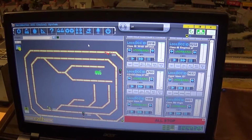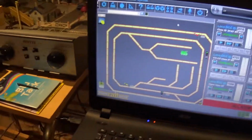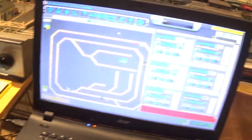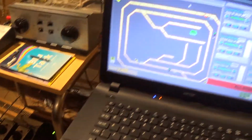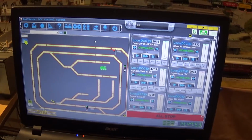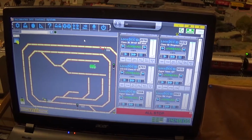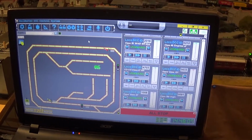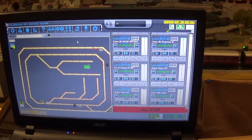Now, remember I said it's not the user-friendly way to say what you've got to do. Mine's the E-Link, there it is. So, you plug that in first, and your PC should recognise something's been plugged in, but doesn't know what it is. So it's going to say USB serial port. You need to find out what COM it's using. Now, COM is communication. That's how it talks to your PC.